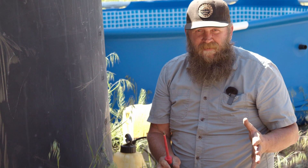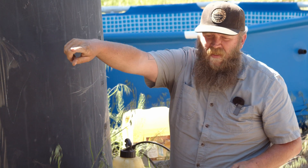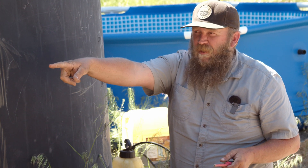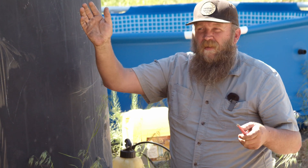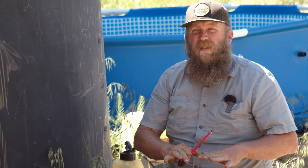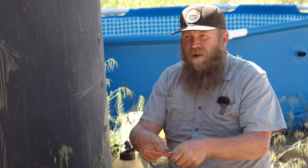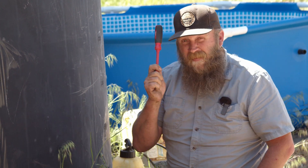I'll connect the ground, then run the wires without connecting them to the solar panel. Run the wires over here and connect them — then there's no power in the entire system, you don't have to worry about anything. In the box at the top of that conduit, all of the other wires will have been reduced into two wires making a single connection. It'll all be running without ever coming in contact with any of the high voltage that solar can put out. Do the bonding, do the grounding, make all the connections in the electronics that don't have power yet, then make the power connection with an MC4 connector. And then you're totally fine — that's just science.